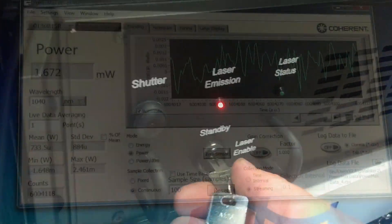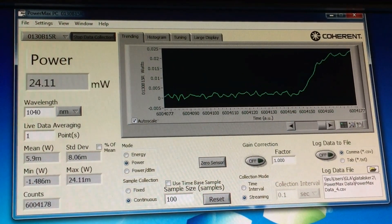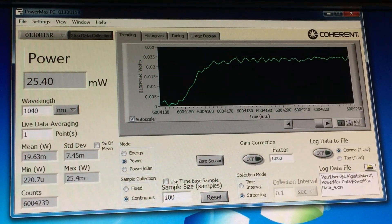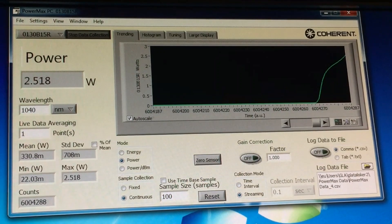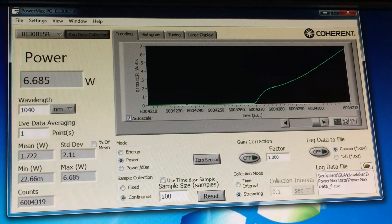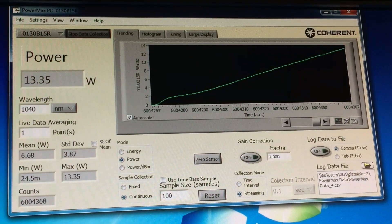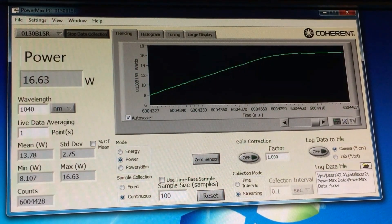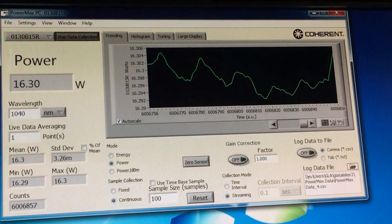But the test is all about the laser, so back in the lab — switch it on. The system is powering up okay, just waiting for the power amp to start ramping up. It is ramping; we're looking for 16.2 watts. We've hit 16.2 and it just needs to settle down. It eventually settles down to 16.3 watts — a successful pass.